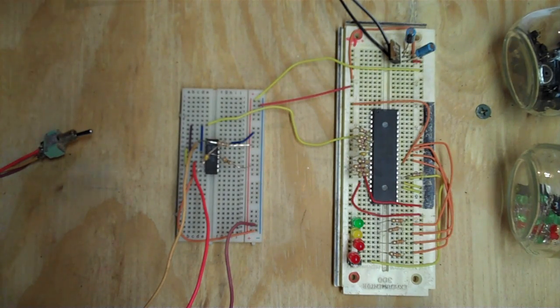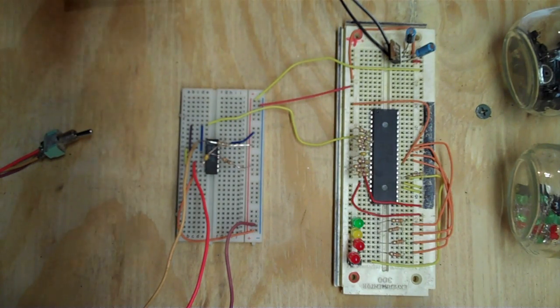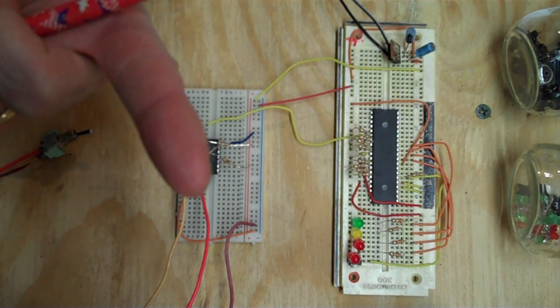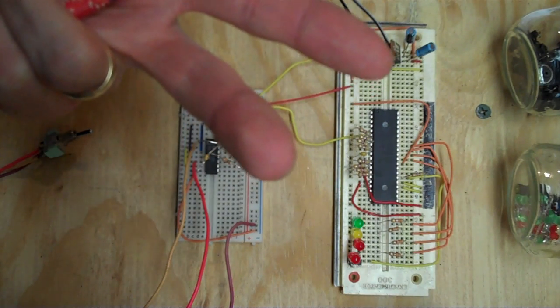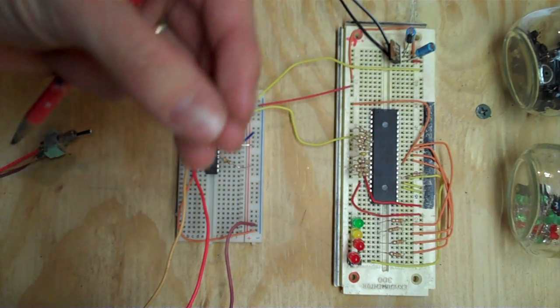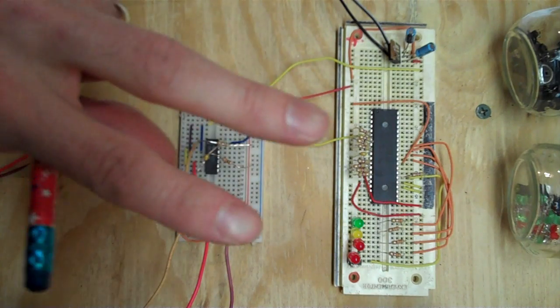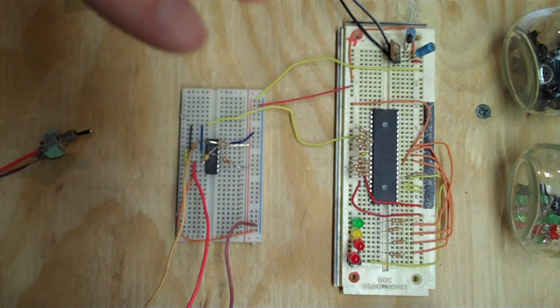Now, not only did it come out as a compatible chip, but it pretty much usurped the market because it was better in almost every respect. It was faster. It had a more useful and more helpful instruction set. It had more registers. It had duplicate registers, which meant instead of having to, every time you did a function, push everything onto the stack and pop it back, you could actually switch the registers around, which made it really handy. It had more interrupt levels.